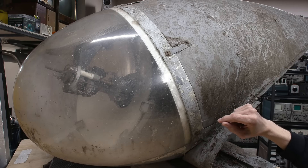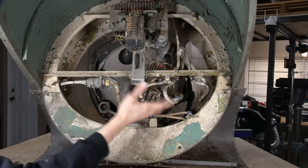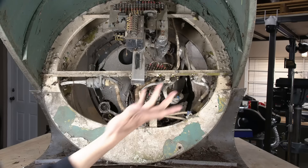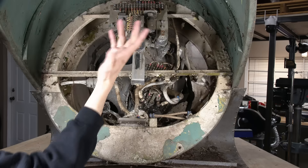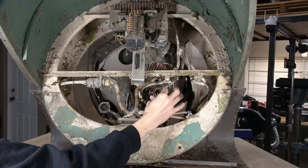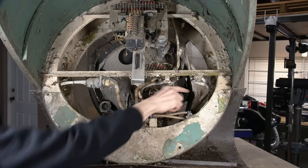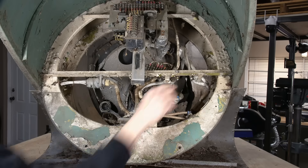And this thing is back in service just that fast. Here's a closer look at the backside. You see lots of wiring harnesses — everything is nicely loomed because this thing is on the bottom side of a wing and everything's vibrating, so everything has to be really tight. There's a spring-loaded switch up here and even a vacuum tube on this side. What piece of electronics is complete without a vacuum tube? There are motors, solenoids, capacitors, and all sorts of electrical goodness back here. Big connectors, big pins — this runs to the carbon rods, and this would go to the control. This solenoid right over there may have initiated the arc. My main focus today is these leads right here — I need to get current into these leads to get the light to happen.